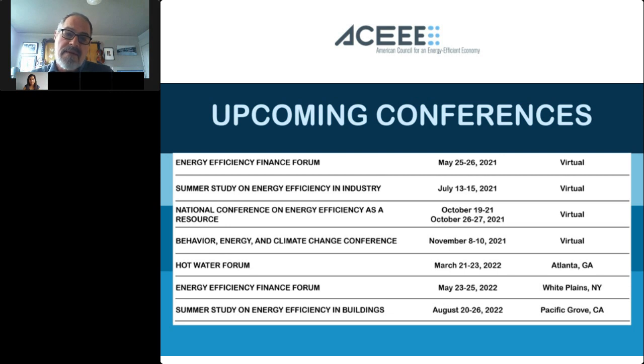The problem is, in my range of experience in healthcare, that small clinic that was only 60,000 square feet had over 100 sinks in it. OSHPD has been requiring redundant water heating. They actually went so far as to say if I had a point of use water heater, I would have to have two of them to provide the required redundancy. Although I'm chipping away at that, because I think the point of redundancy was that if you had a failure of your water heater, you would have another water heater to back it up. But in the case of using a high efficiency point of use heater, that's a whole different picture. If that heater breaks, you just replace it within the hour.